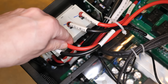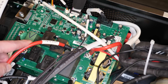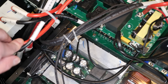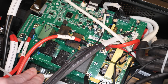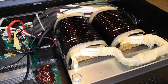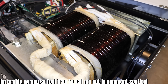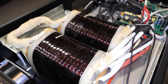I've been checking the tightness on all the wires and everything appears to be connected pretty solid. On the back of these circuit breakers, the input breakers go to one board and the output breakers go to that same board. I'm not going to pretend I know exactly what everything is in here. Back here we have the ginormous split-phase transformer. I think what it does is receive 48 volts AC and step it up through the transformer to output 240 volts, with a center tap that allows you to connect your neutral for split-phase.